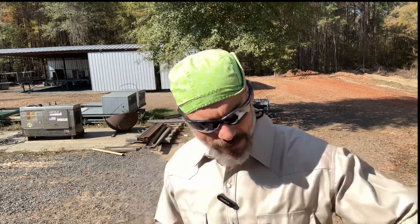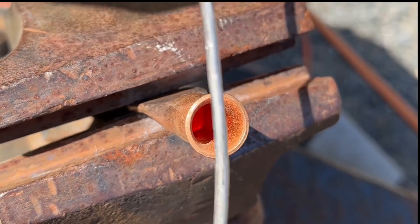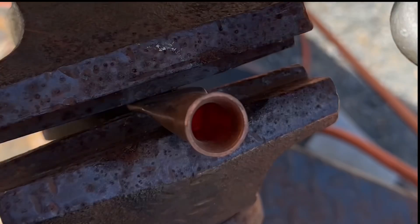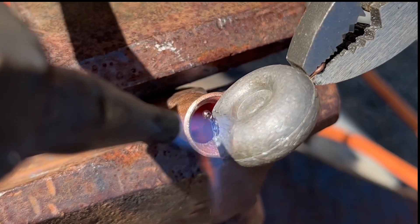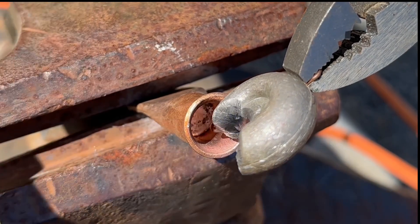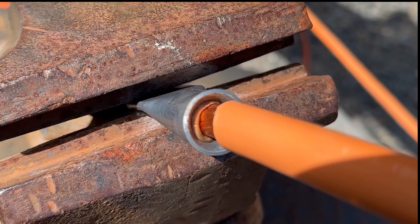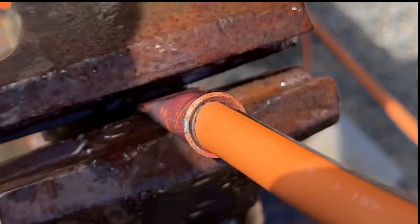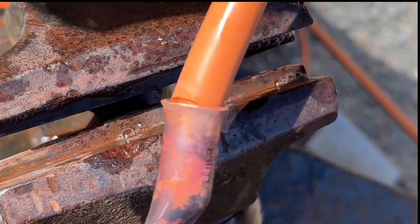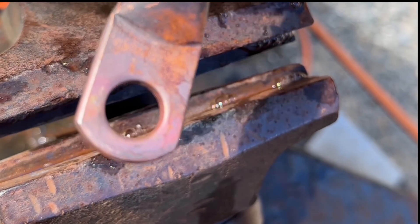Now, how to make the best connection. Here's the best way I've found to connect your welding lead to your lugs. You can use solder, fishing weights, or wheel weights - it doesn't really matter. Today we're going to use a fishing weight. Put that in there - that ought to be plenty. It's good and hot where it's liquefied in there. Before you burn your lead up, pour a little water on it. That baby is on there. And if you want to get it back off, you can just heat it up and use it again. Have an awesome day, later.